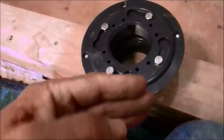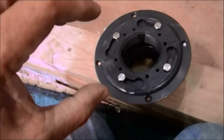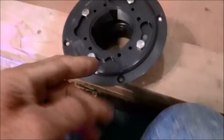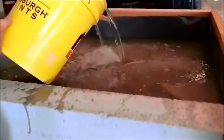I did a mock-up, and a guy named Isaac Ostrom did a mock-up where he poured water into a shower pan that was, you know, 2 or 3 inches thick around the perimeter, and then obviously sloped down to the drain. He poured water into that mortar mix, and it all evacuated. So you're going to tell me that this much mortar, water could get through and evacuate, as he showed in his experiment. Try to keep it from splashing out.